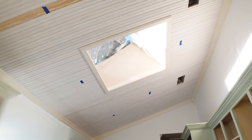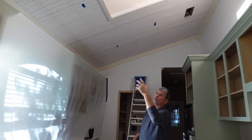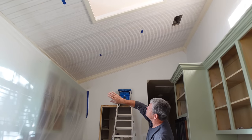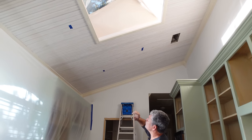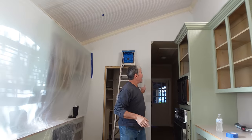Here we are at our little kitchen refresh project. You're probably asking why we didn't show you this one — two reasons: we simply didn't have time to film it, and we've already got a bunch of kitchens on our channel. Today we'll take a quick tour and show you some highlights. We'll start with this beadboard ceiling. Originally it was drywall, and the owners wanted beadboard to match other rooms in the house. Jordan and I put one-by-three strapping across the ceiling at every joist with a screw, giving us nailers for the beadboard, and we drove a nail through the tongue of the beadboard into that strapping so you never see the fasteners.